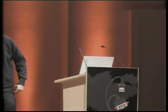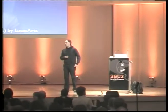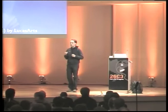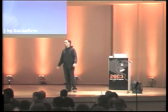Yeah, go ahead. My question is, do you know about some people who use power glitching in order to disable the Jtag disabling in the beginning of the boot process? Sorry, can you speak a bit louder? Yeah, I'm sorry. Do you know if some people use power glitching in order to skip the instructions that disable the Jtag in the beginning of the boot process? Yeah, so using voltage glitching to skip that instruction is definitely a possibility. So this is another reason why you should not rely on your code disabling Jtag. Exactly. Yeah. And yes, I think that's also how some people have been successfully able to read out those LPC microcontrollers. Okay, thank you.